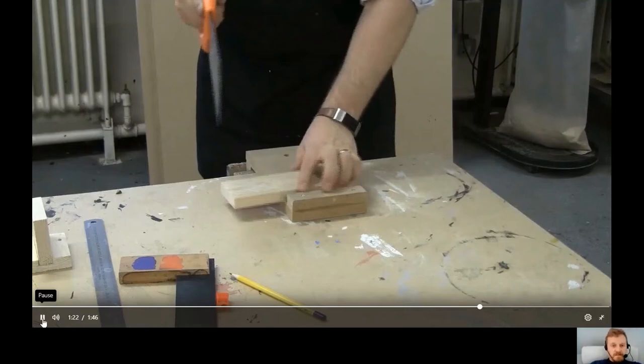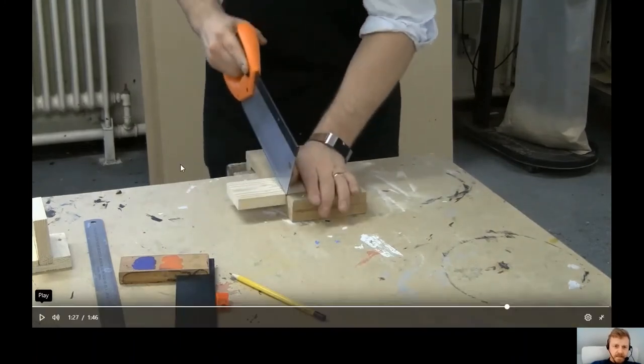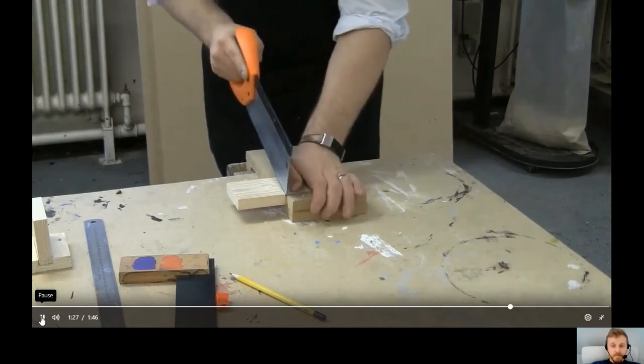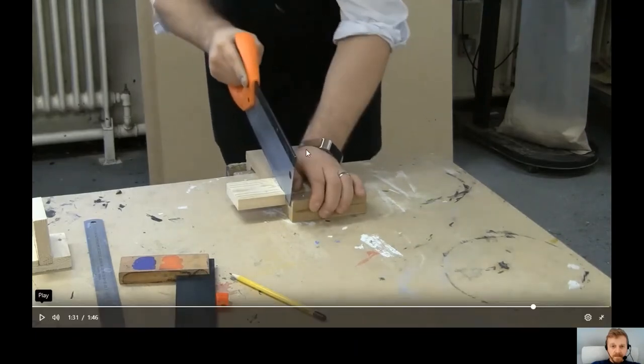Check that you've cut through a bit. Your index finger should be on the right-hand side of the saw, with fingers clear of the blade but clamping against the edge of the bench hook, and your palm pushing against the wood to stop it moving. You can also clamp the wood down with a G-clamp or quick-release clamp if you're struggling to hold it.